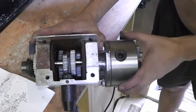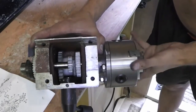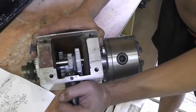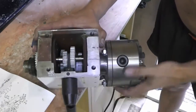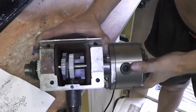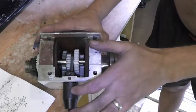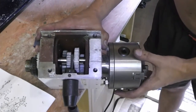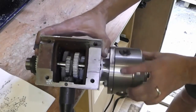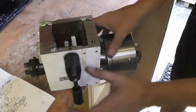Now, you've got high-low gear in there. When that's spinning, that's currently in neutral. Whack it in the high gear, and you can see it starts spinning all the shaft and bits and pieces. Back into neutral, and the other way is the low gear that you do have to wiggle a bit to get it in. So essentially what we've done is replaced the bearing in here, but you've got to strip the whole lathe down to do that. My fat gut was in the way then. Much fun. So I've still got lots to do.